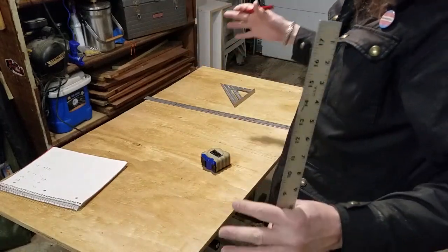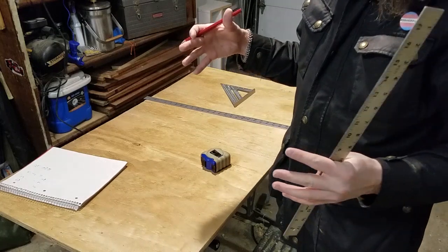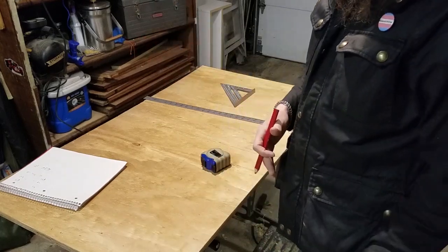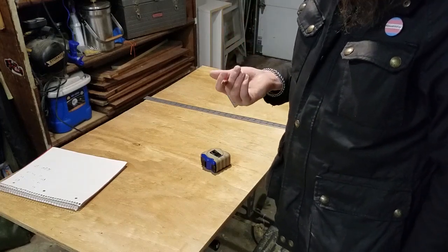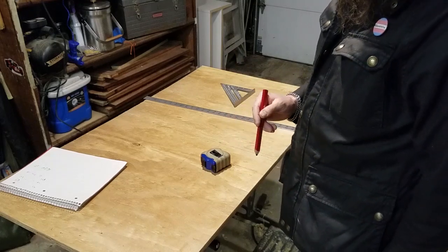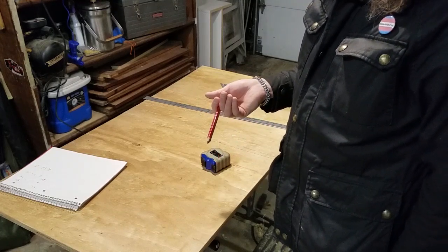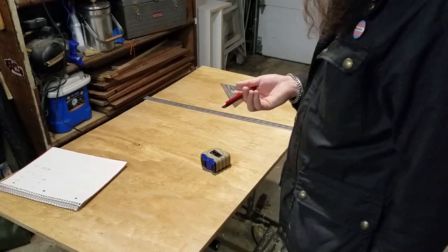All right. So, the Duster One design, back when it was still a thing in like the 60s, it said that every boat had to be within 1/4 inch on all of its half breadths. That means that overall, the boats could vary width-wise by 1/2 inch in pretty much any dimension. I am doing my best to get it to within a pencil line. So I should be within a 32nd, a 16th, hopefully, if I keep double checking my measurements. I've never built a boat before, so saying I'm going to build a perfect duster is kind of hubris, but I'm going to do my best. I'm going to get it as close as I can.